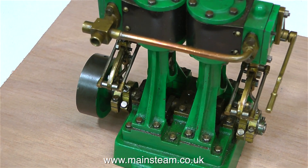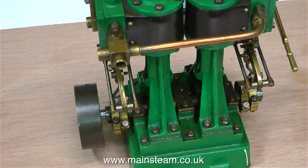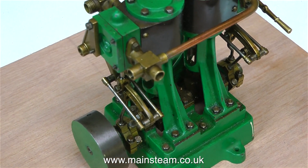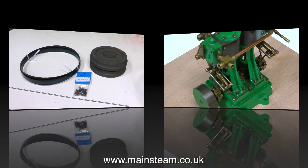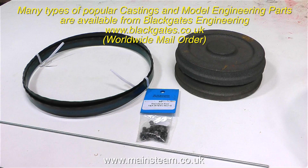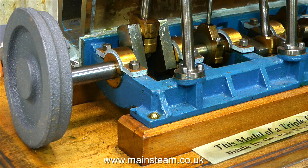The first things are obvious. Some of the nuts are missing from the steam chest, and there isn't a displacement lubricator — there's just a hole where that should be, which will need plugging. Before I start this job I need to quickly go up to Blackgate's Engineering for some parts. I need some 7BA nuts because I don't have any. While I was there I also bought a new bandsaw blade and a piece of silver steel, because I intend to make two crankshafts — one for the last horrible engine and one for the Stuart twin launch I'm working on. The silver steel will be for pinning the crank webs to the crankshaft.